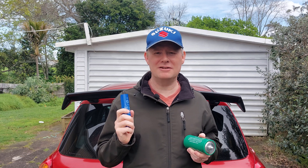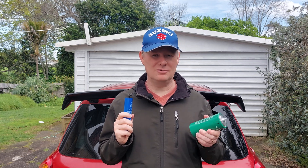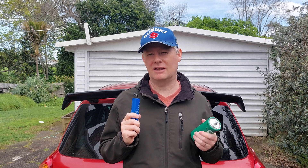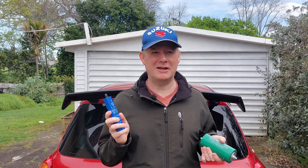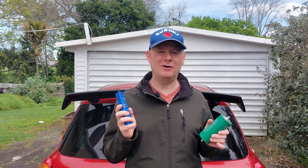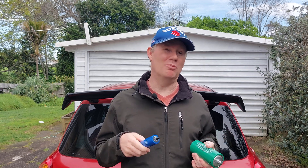LTOs, as I've learned even more recently, you can pretty much charge or discharge them to pretty much zero and they are okay. I'm part of the Facebook group for these, and sometimes people get them delivered at zero volts, charge them up, and get full capacity. Also you can pretty much overcharge these seemingly with no ramifications — they apparently explode at around five volts, but that's miles off the recommended 2.8. Seems you can charge them to three volts pretty much fine.